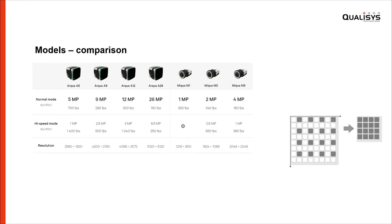Here we have the resolution of each camera, which also shows the aspect ratio, varying from 2:1 to 4:3 and 1:1. We also indicate 3D resolution, which is basically the smallest motion you can detect at a 10-meter distance with standard optics, and it correlates very closely to resolution.